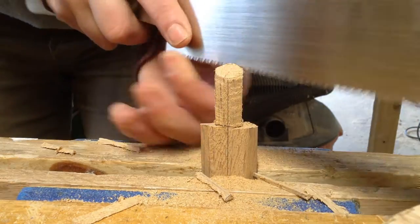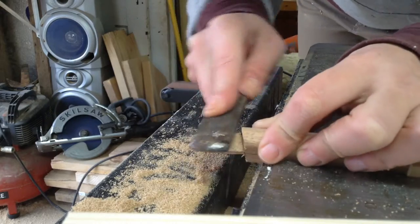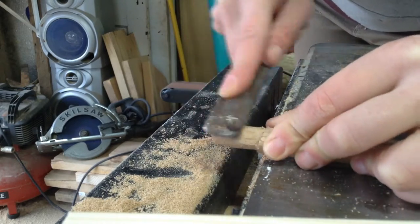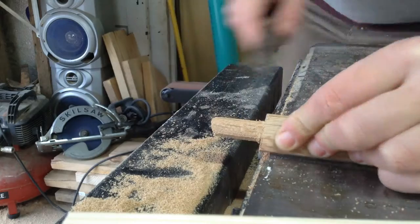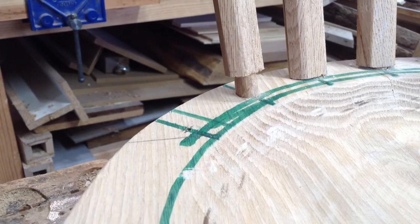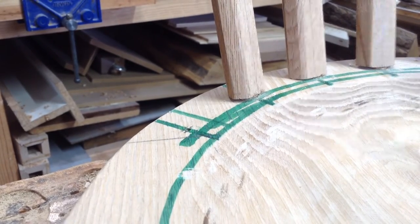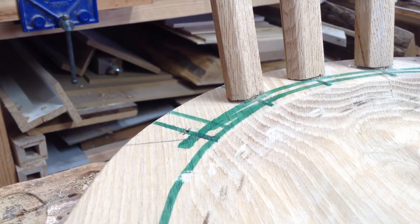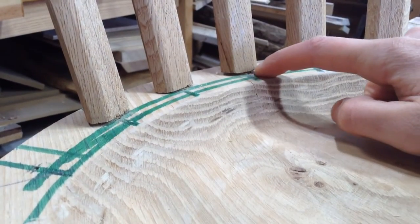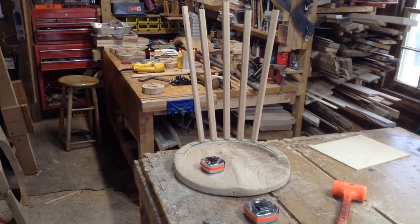I cut little corners and trimmed off the edges around that circle so I didn't have a ton of sanding to do. You're left with about an inch-long dowel nub that can go into those holes. These will all need to be cleaned up after cutting with the saw. I used a rasp to remove some of the excess material quickly, then it was just a matter of removing a little, testing it in the piece, removing a little more, testing again — back and forth until I got a nice fit. Once all done, these will be cleaned up a little more so they fit nicer. Some are a little bit higher off the base than the others, but I cleaned all that up — just a matter of fixing the angles a little bit. And then those are my five back rails in place.